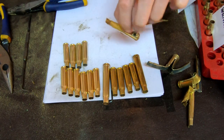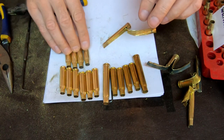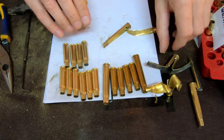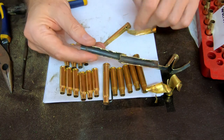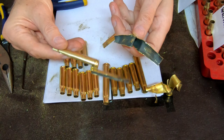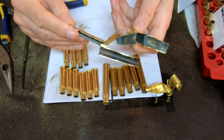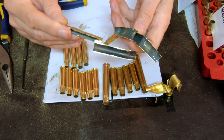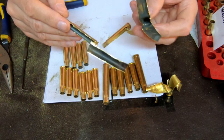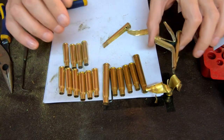I'm quite happy with the stainless steel one, so that is what I would like over there. Although the ultrasonic cleans it up nicely, that's that one. And then the two pieces, the corn cob and the walnut, it just doesn't clean it at all. So there's proof that it hasn't cleaned it. And yeah, so gentlemen, if you have a look at this, you can make up your mind what you want to do, but I know what I'm going to do, and that is stainless steel tumbler.